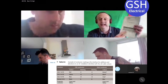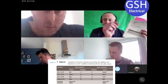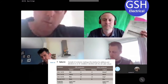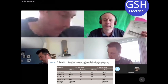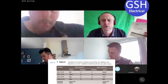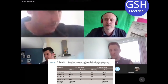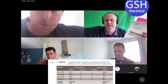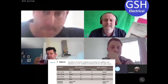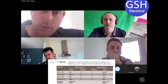So it's clearly laid out for you there that when interfacing 3-phase colours, you must mark them, using those little ringlets that we've seen on college, identifying conductors when we've used them in single-phase consumer units just to do a better job. We're probably going to be using something like that when joining 2 cables together. So super important. Open up a consumer unit of mixture colours. With a 3-phase consumer unit, we've got a lot of pre-2004 cables feeding machinery, and you introduce a new machine in the new colours, identify them at the point of connection within the consumer unit. So in other words, at the 3-phase breaker and the neutral bar.